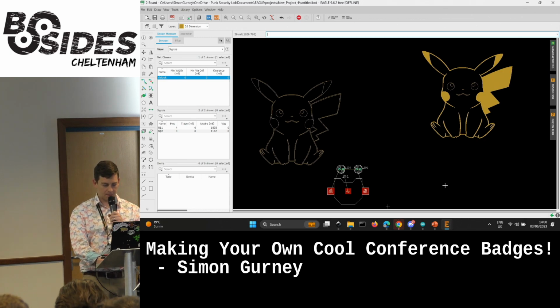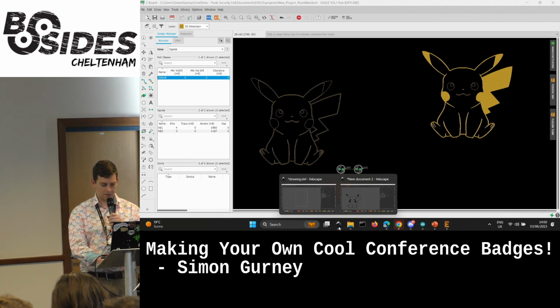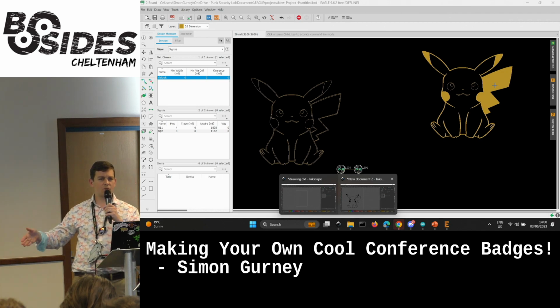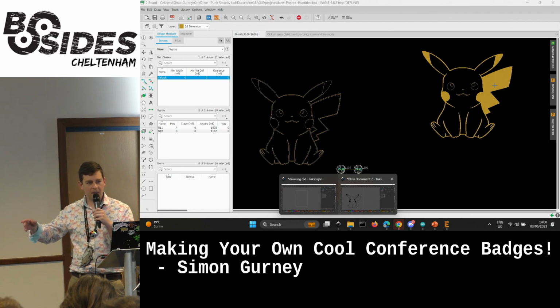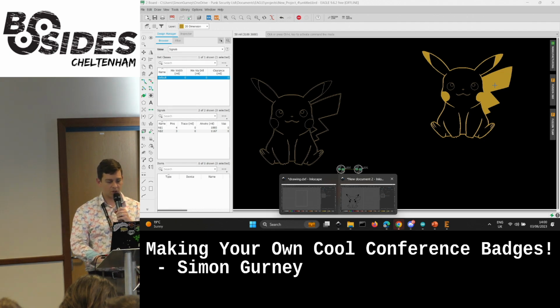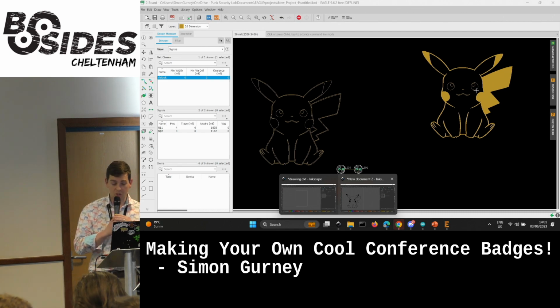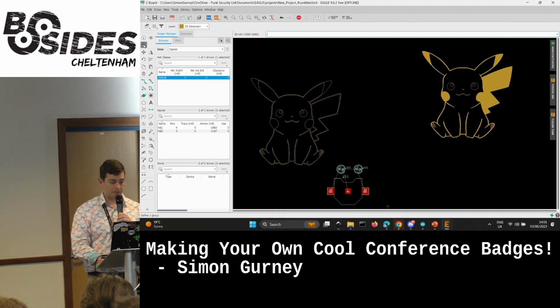Now, where's the original gone? Okay, so it's filled in some of his tail there, so we've lost the definition of the tail. So we have to do the same trick. We have to put that slice in so that the polygon is seen as the outside of the Pikachu rather than the whole Pikachu. But we've got this bit, and if we wanted this bit to be white now, which would be super easy, that's the silk screen layer.